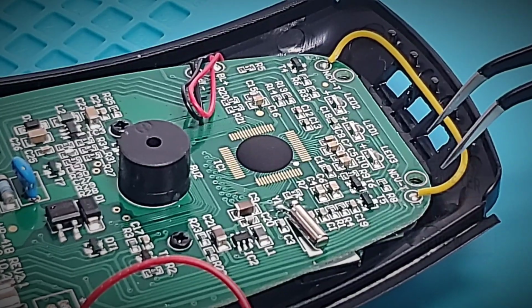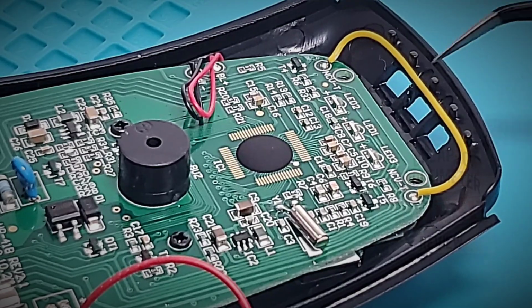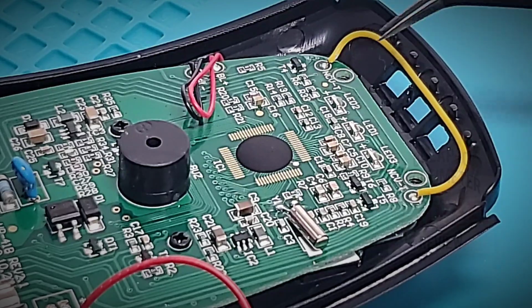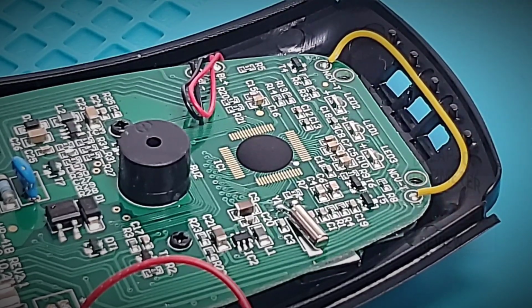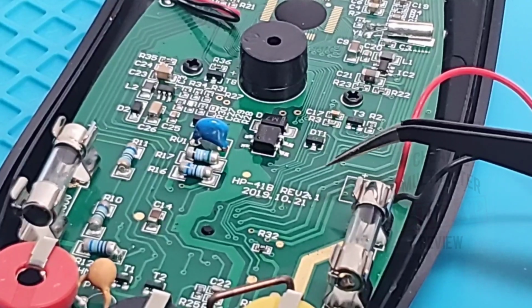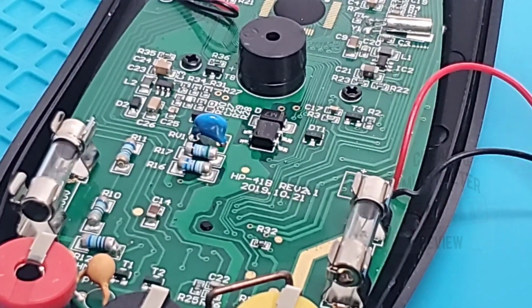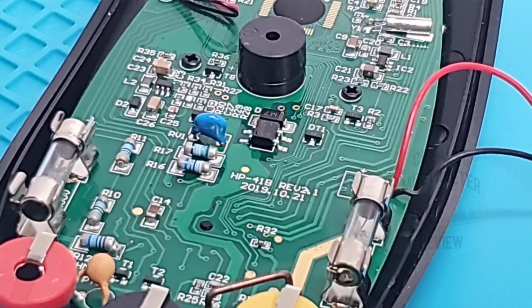Cool. So normally what we see is an embedded wire in the PCB itself, or we'll see an extruding protrusion, as I like to call them, for the NCV, an actual metal filament coming out of the multimeter. But in this case, they've utilized a basic wire. And you know what? At the end of the day, it works, and it seems to work quite well. Good stuff. Check out that fab date, 2019, 10/21, October 2019. Not too shabby. Overall, nice, clean PCB, and I like what I see.